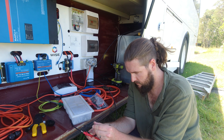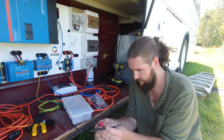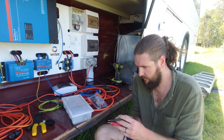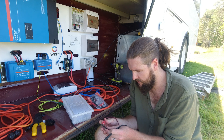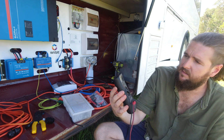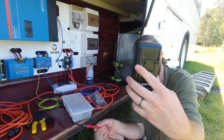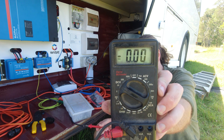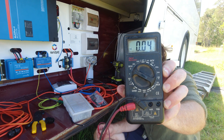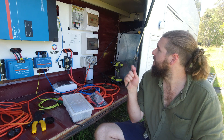This next process is really important. I needed to make sure the positive current of power coming down the cable was going into the positive breaker and not the other way around — getting this backwards could damage our system. I'm seeing a dash, and I'm hoping that doesn't mean I've got these backwards. Right here I've got DC000, and if I touch positive to positive, that negative sign comes up. Then if I touch the positive to this side, I get a voltage and it stays positive, so I think this is my positive.